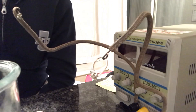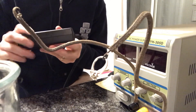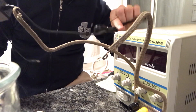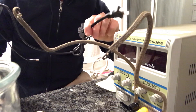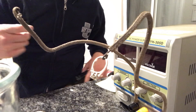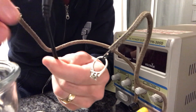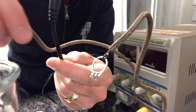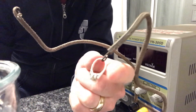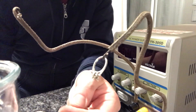If you don't have a dedicated power supply, I would recommend using laptop-style adapters. One side plugs into the wall and takes AC current, and out the other end comes DC current. If you've got scissors, you can cut it right here, and then one of these wires is positive and the other is negative. The positive one is the one you want to attach to your anode. The other one's called the cathode.